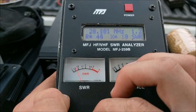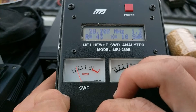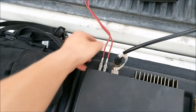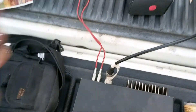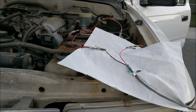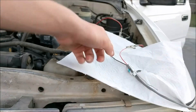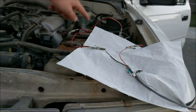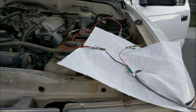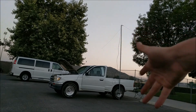So this is a pretty cool little SWR meter, and if I tune into the frequency I'm going to be transmitting on — 28.385 MHz — I can get a relatively good SWR. To power this ham radio I have two alligator clip wires going to two wires from my radio, which go into the two terminals of my car battery, so I can power my radio from a relatively stable voltage source.